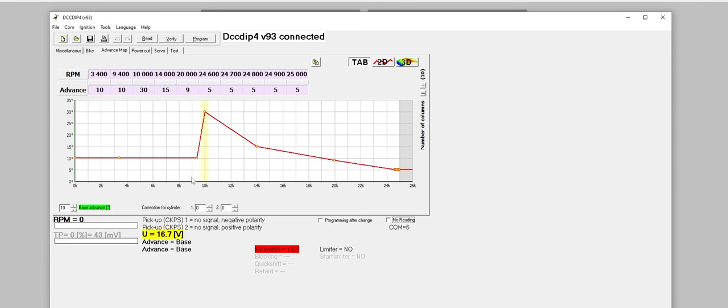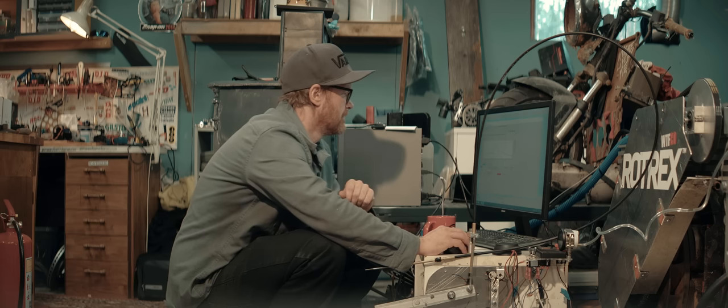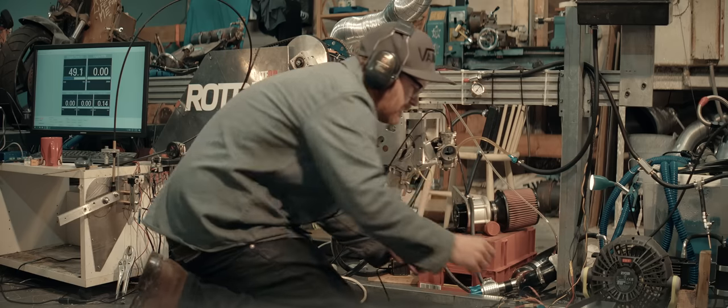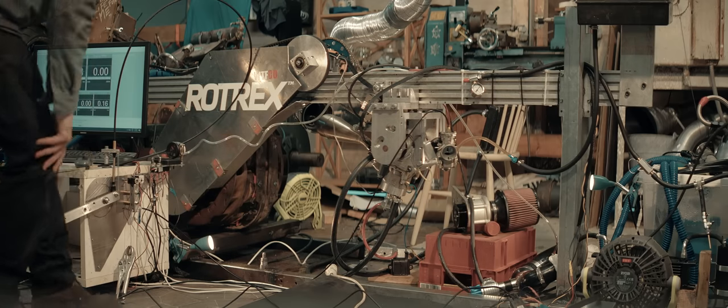Basically just a flat line. I wasn't going to rev it any higher than this while testing the ignition. I forgot to reset it, and as you saw, it can't rev past like 6, 7, 8k without more ignition advance. Normal ignition curve and 110 main jets. Ignition curve even higher. There's some weird cutting out going on though. I have some theories about that.